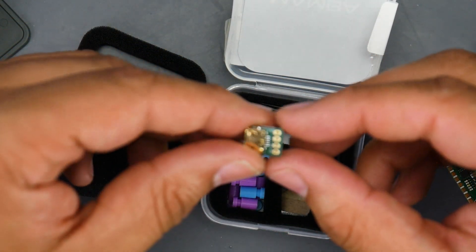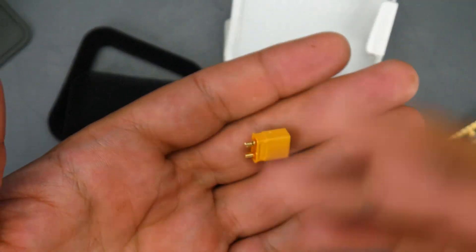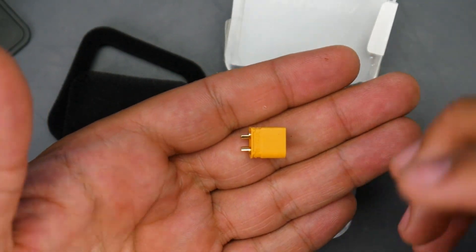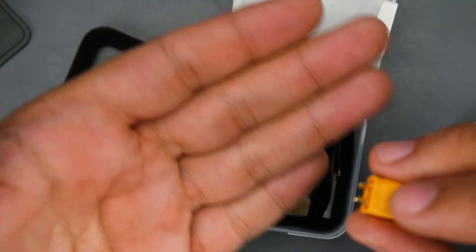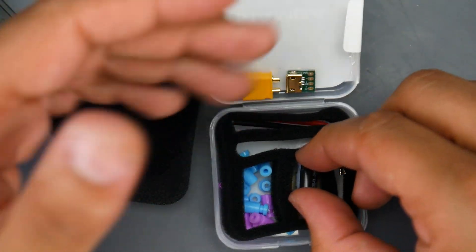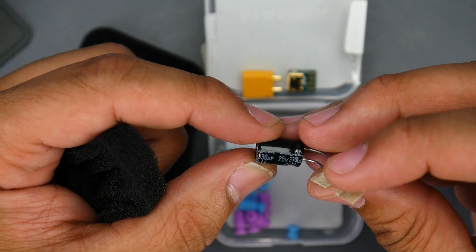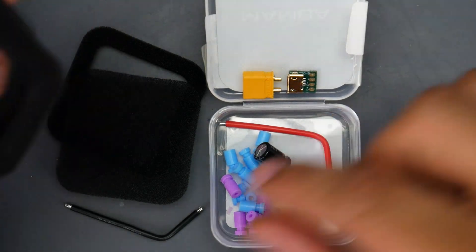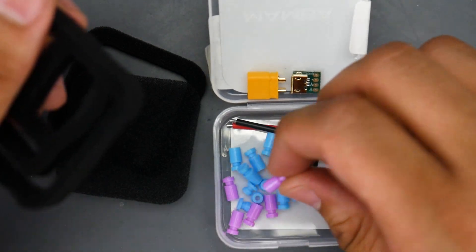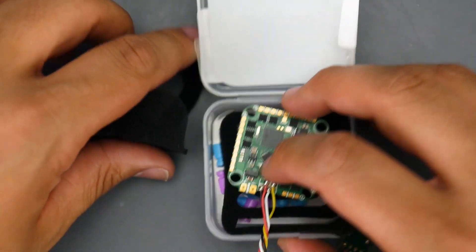They include a capacitor, and they also provide a micro USB in the package so you can swap it out easily. They're showing an XT30, which is a telltale sign — don't put this on a heavy demanding setup. I think a 4-inch, maybe 6S, would be the maximum. They provide a Rubycon 330µF 25V low-ESR capacitor, which is right on the edge for 6S. I'd highly recommend going with a 35V capacitor — the 25V might degrade over time. Also included are rubber grommets.